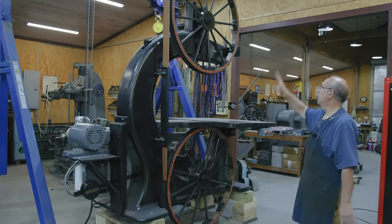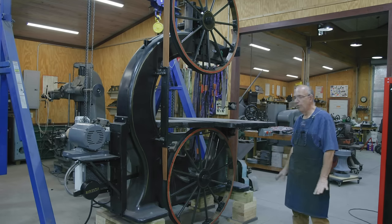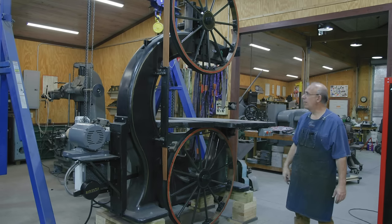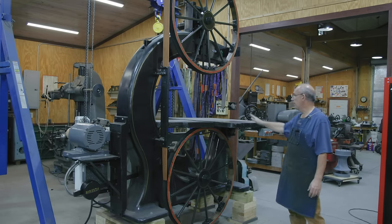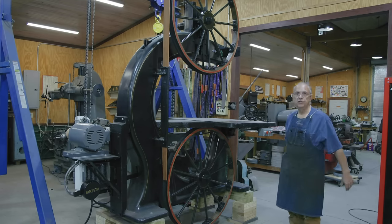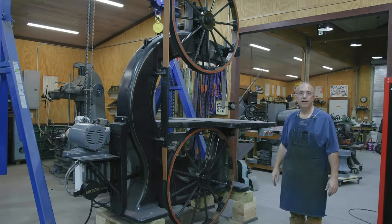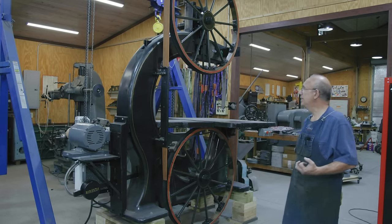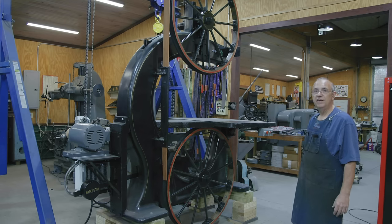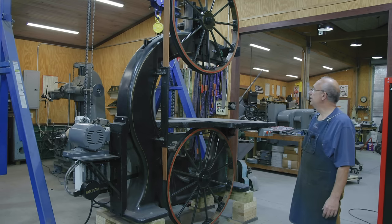Here's my game plan. I'm going to take the wheels off of this machine. As you guys know if you've been watching this series, the bottom wheel is designed to go into the floor. We have this machine up on stilts right now, and we do not want to haul it this tall — we want it sitting down closer to the ground. So we'll take both wheels off, take the table off, put everything on pallets, and forklift the machine onto a trailer. We'll probably put some shrink wrap around the whole thing for protection, though it's cast iron — it won't hurt if it gets a little wet.